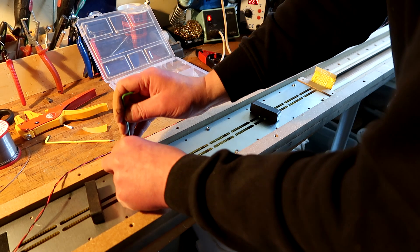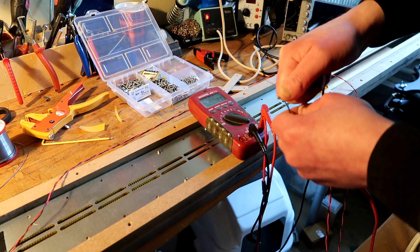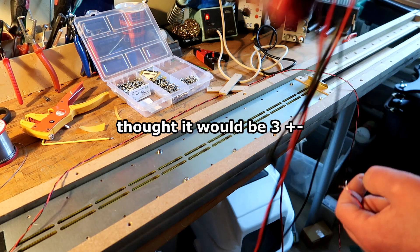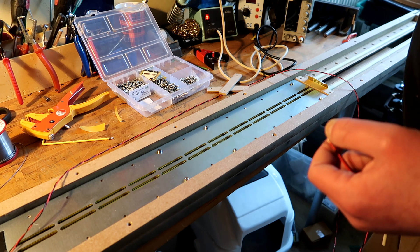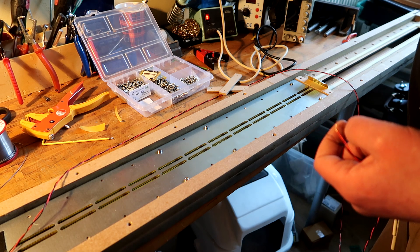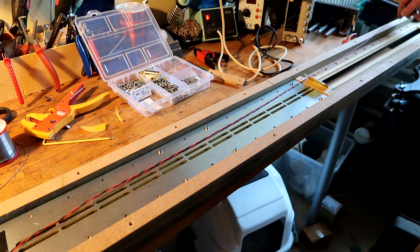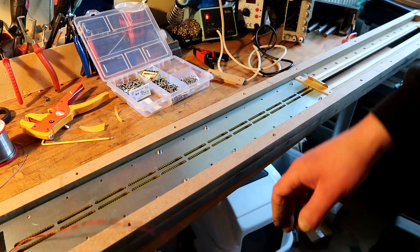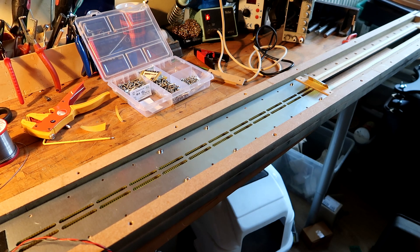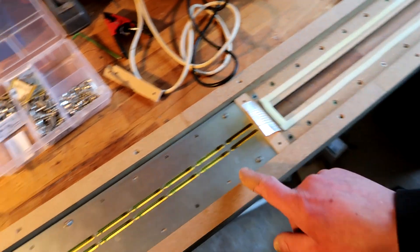Let's see what the impedance is. It is much higher — it's 4 ohm. It's even better combined with the 8 ohm. Kind of weird but cool. Maybe the foil is thinner, maybe the trace is cut slightly thinner — who knows. I'm going to check this real quick, see if it rubs and how it sounds, before I do the second one. Then I'll decide if I want to go Kapton or not, and if I have to change out this foam, because this sucks. Here there is enough clearance in the middle, but somehow there is not enough clearance to the magnets, which is ridiculous. The frame is flat — it's the same foam. Why is it acting up weird there?